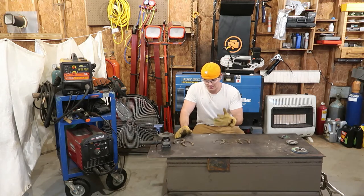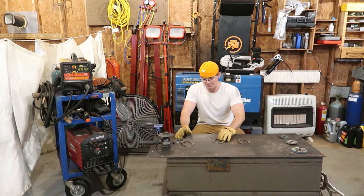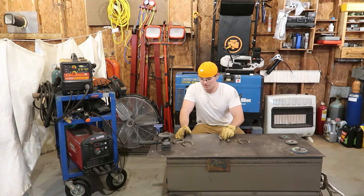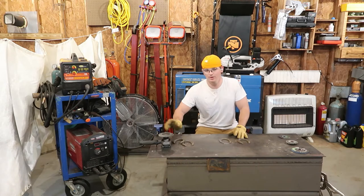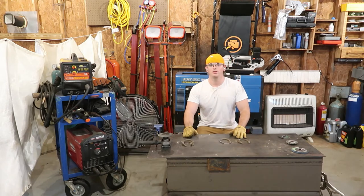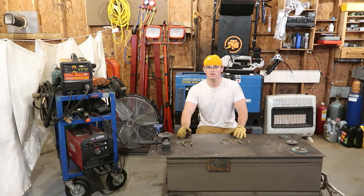Typically when I use a flat wheel I like to use a mask — that's sandpaper. Little particles get everywhere, but for that quick little process I didn't really see the need. Now we got the shoes cleaned up. I'm going to leather up real quick and cut the welder on, and we'll tack these babies up.